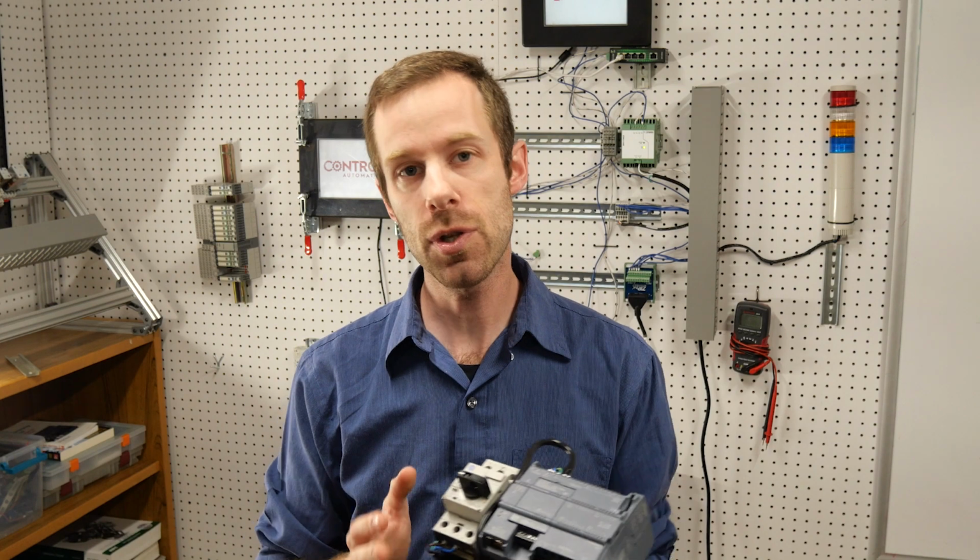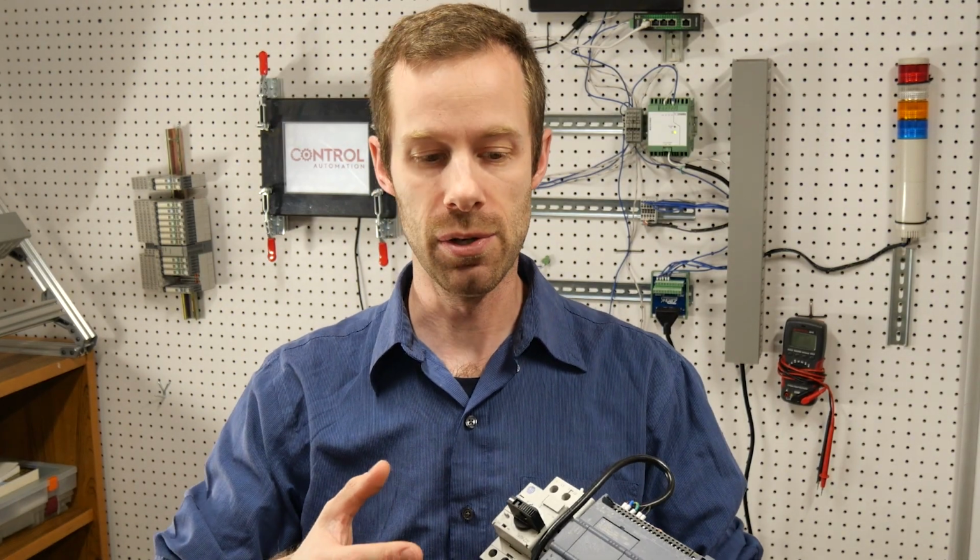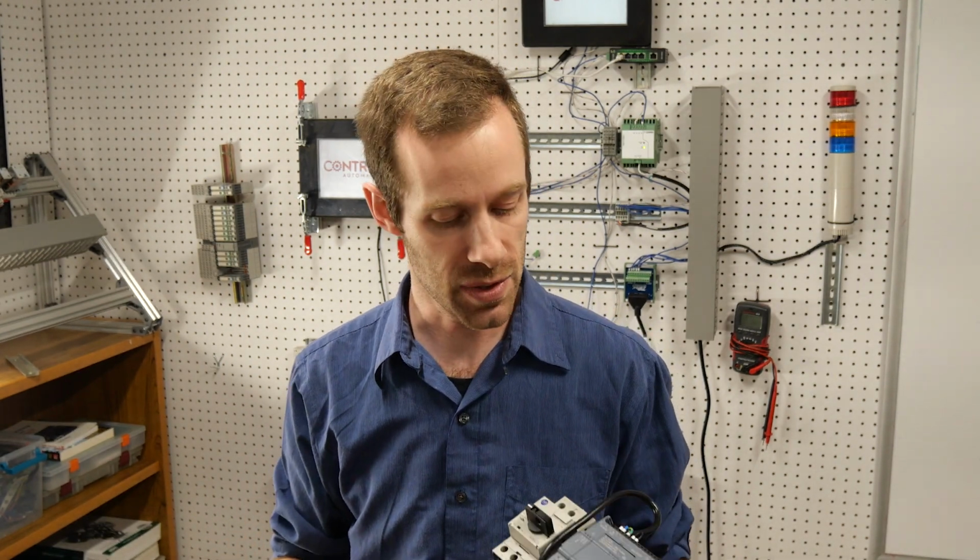If you take a look at your computer, most laptops are going to have a connector for Ethernet, and they're certainly going to have USB connectors, so those are the two most common ways to be able to get our computer to talk to the PLC. But when we're trying to build a PLC network that will connect to, I don't know, other PLCs, touchscreen HMIs like these ones behind me, motors and frequency drives, all kinds of different components are going to require different network capabilities. So we have to consider what our system is going to include before we know what to purchase.